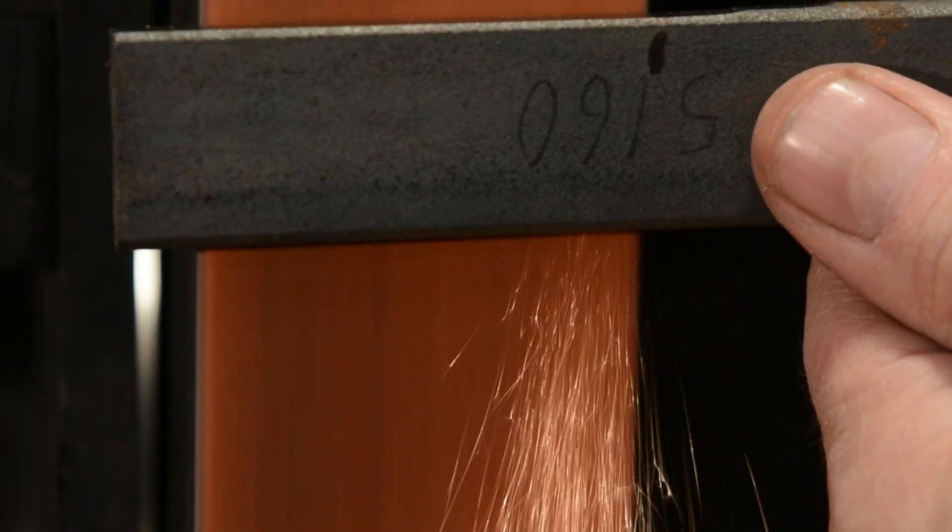That means you have to apply a little extra pressure at the plunge line to get an even grind straight across the top of the blade. I'm exaggerating here — you don't actually want to rock the blade off the belt like I'm doing here, but that's kind of the feel that you want. I usually do it with my thumb — just that little bit of extra pressure, a little bit of extra attention right there next to the plunge line. When I get right close to where I want to finish the grind, I feather the blade onto the belt, usually sort of in the middle, and then gently bump the belt into the plunge line, being extremely careful to give it gentle extra pressure there. If you don't keep firm pressure against the belt at the plunge line when you're doing this, the other side of the belt will cut into the bevel, making your grind wiggle, or in worst case, the entire blade will bounce off the platen and your grind will get out of alignment. In all grinding, you want to feel that flat against the belt and hold it there — never let it bump off.